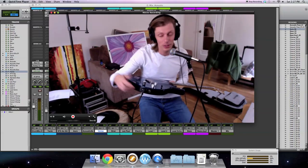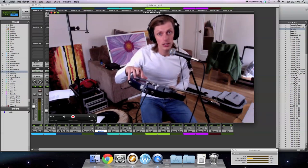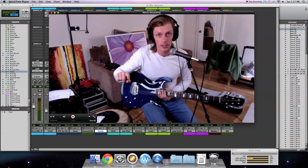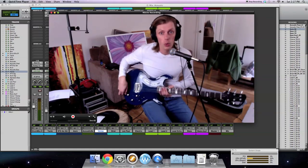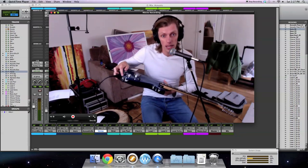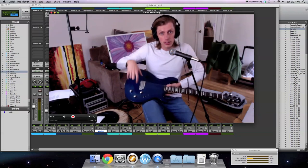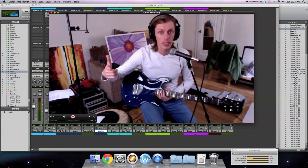There's a Variax cable — it's kind of like an Ethernet cable for a computer, but it has some special things about it so you have to use the Variax cable. It does a couple of things. There's the digital signal processing that goes on inside of the guitar. The analog signal from the piezo pickup goes through an analog-to-digital converter, and now it's a digital signal. The DSP chip inside of the guitar does the processing on those signals digitally. Then, in order for the signal to come out of the quarter-inch output, it has to go through a digital-to-analog converter.